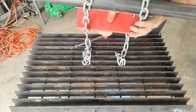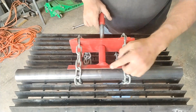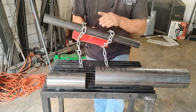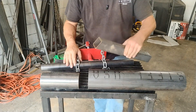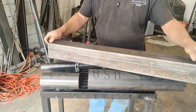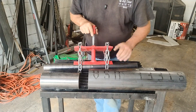There you go. Now if these were chamfered you could adjust your gap, get it in there, tack it, tack it, tack it, take this off, weld it out. This same little device will work on smaller pipe, big pipe, medium sized pipe, square tube — it'll even work on this big four inch square tube — angle iron, you name it.